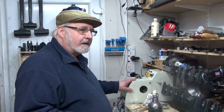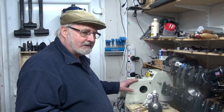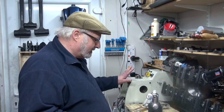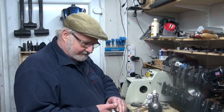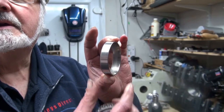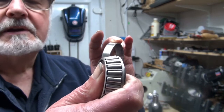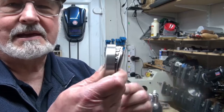And on occasions I heard a sound similar to when you've got a wheel bearing gone on a car — a bit of a drone — which it didn't have when I first had the machine. A droning, moaning sound. Anyway, we've taken the bearing out and all I can see is some wear on the inner surface there. And under very close inspection there is wear and marks on the rollers.